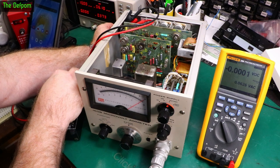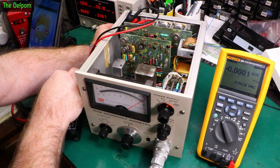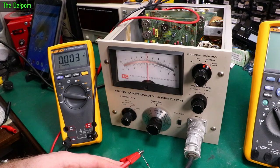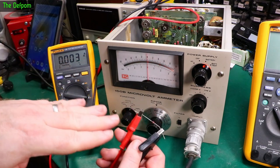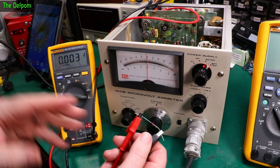The chopper frequency changes, so it needs to stay above 5.7. We have a little bit of information at least. Well, I'm going to try an experiment. I've got a 6.2 volt Zener here, which I'm going to use to effectively simulate the battery loading.